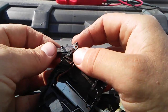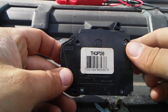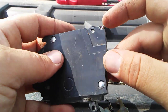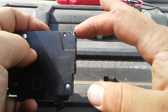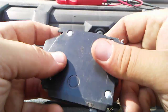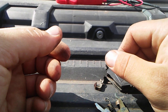I think this is interesting and something you guys ought to watch out for. If you have these breakers in your panel, it might be worth your time to just pop one out — of course, shut the power off first — and see if it wiggles at all. If it wiggles, personally I'd replace it. Five bucks for peace of mind that it's not going to burn your house down.